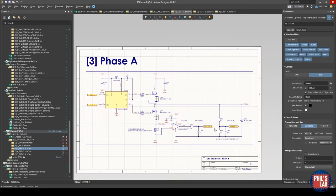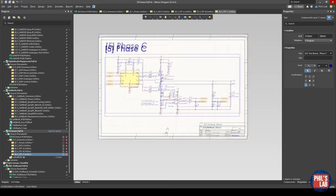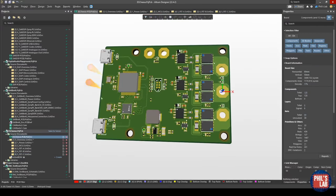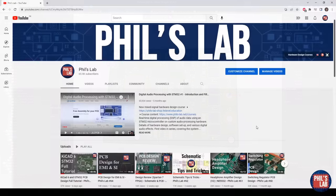A very simple ESC design — a lot of commercial ESCs contain just this circuitry and the microcontroller, minus the USB high-speed physical layer. With three phases A, B, and C, that's all you need to make your own ESC. In future videos, once I've finished layout and routing of this six-layer board, I'd like to go through how to actually route and lay out an ESC, and then write a simple algorithm to control the brushless DC motor. Thank you very much for watching. Please leave a like and comment, and subscribe if you're new to the channel.